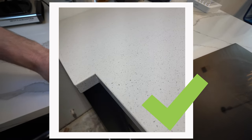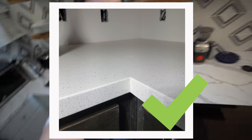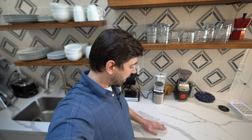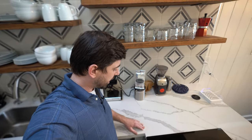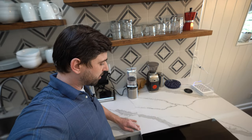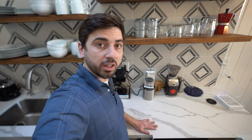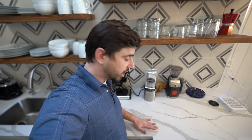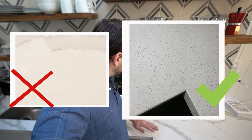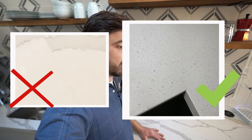Anytime you're doing so many little twists and turns, not only are you making your job more difficult, but you're creating areas where it's going to collect trash and it's always going to look dark. This does need a little more epoxy and a little bit of cleaning. Another thing: obviously before you glue any of this, you need to clean it really well, because your fingers touching it before gluing will create dirt and it's just going to magnify that edge and not make it look as good.